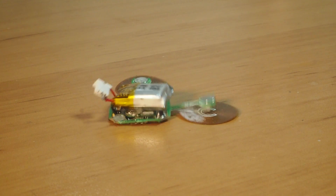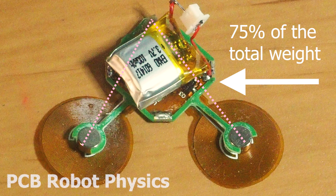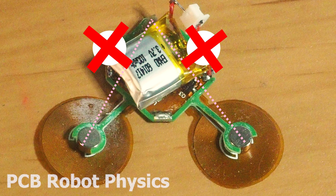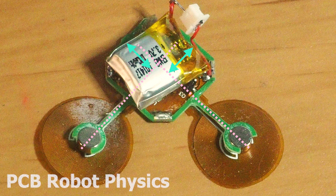The front part of the robot is now resting on one small point that is forming two axes of rotation. Most of the robot's weight is in the middle, but ideally it would be concentrated on these two points over here. Practically that doesn't make much sense, and the distance from the pivot would also be very short to provide an effective turning force. So what if we bring the pivot a little bit lower? This would increase the turning distance and also let the robot rotate most of its mass.